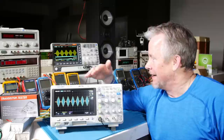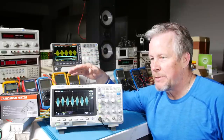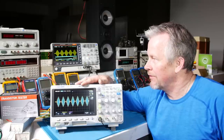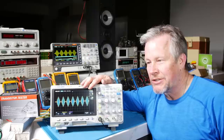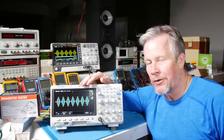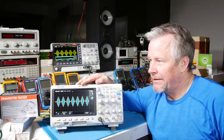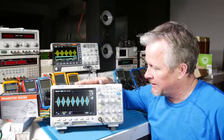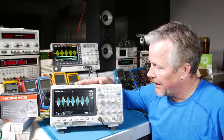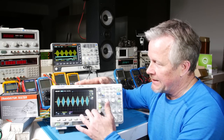I do power supplies, audio stuff, and switching power supplies that might go to 5 MHz — the fastest ones I've dealt with — and they might have oscillations or ringing on switching edges that might be in the 10-20-30 MHz range, but I haven't had a problem capturing anything. Hopefully this answers a lot of questions you might have had about oscilloscopes. The other thing to be aware of is screen size.